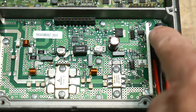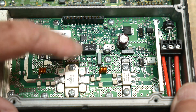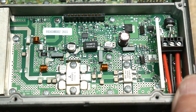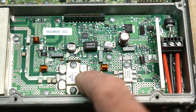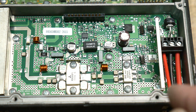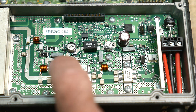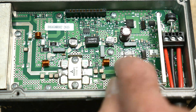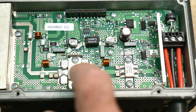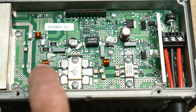The power comes in here. There's a big diode for reverse protection. And there's the money shot — that's the big 60-watt FET amplifier, Mitsubishi. That's definitely worth $15 all by itself. Supposedly good to 60 watts, and it needs a driver — I think this is a 15-watt driver. So this takes about 1 watt in, 15 watts out, and this stage is 15 watts in, 60 watts out.